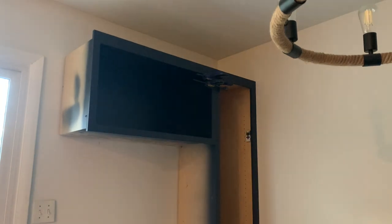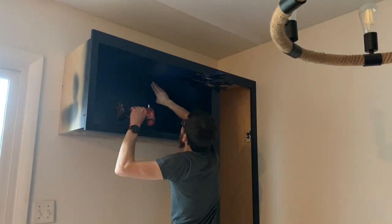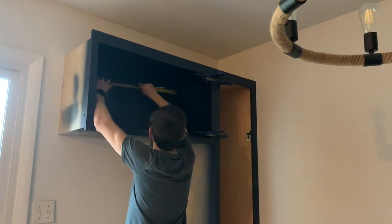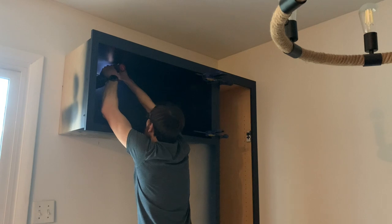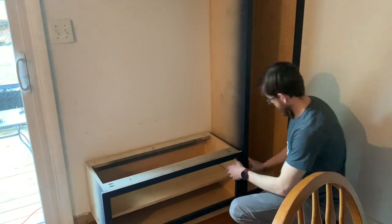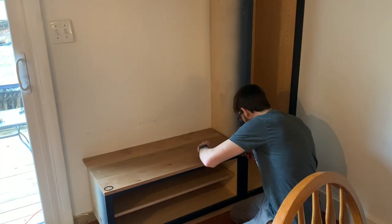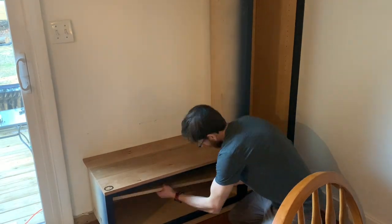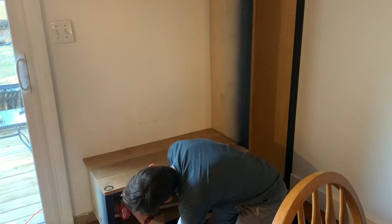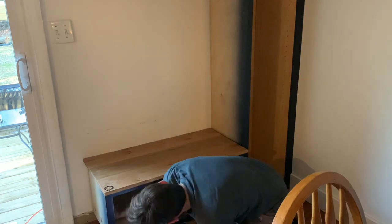I used dominoes to help align the face frames between the upper cabinet and the side cabinet — the dominoes slide the cabinet over and the face frames automatically line up, so I don't have to worry about that. I can clamp it and then measure over for all my studs and hit the studs with the screws to make sure it is nice and secure. A very similar process with the lower cabinet — just set it in place, it lines up by default with the dominoes, and then we'll set the top in place and screw the top to the cabinet.